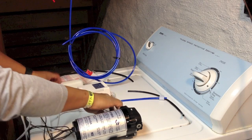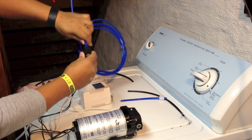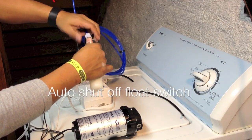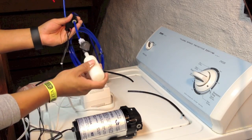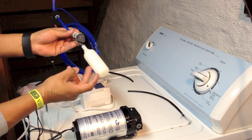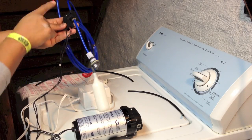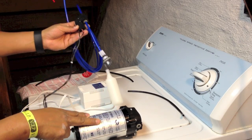What's going to happen is we're going to install the auto shut-off switch on one side, then connect another tube to it, and the end of the auto shut-off valve will close the connection when pressure changes. When the pressure changes, the auto shut-off valve — specifically designed to work with the float switch upstairs — will shut off the RODI system, and this auto shut-off switch will shut off the AquaTech pump.